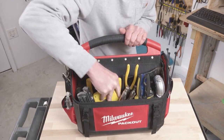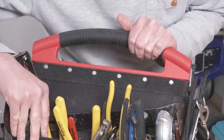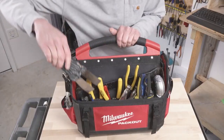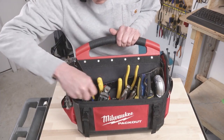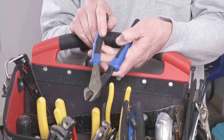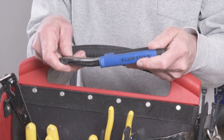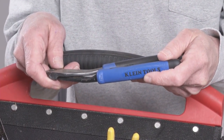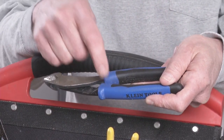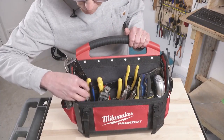I have a hundred-foot tape measure in here. I don't use it very often, but when you need it, it's the only thing that works. A couple of putty knives — one that's a real beater and one that's in a little better shape. These are the best diagonal cutting pliers to buy — these are Klein's. They're angled and allow you to pry and cut nails, pull out electrical cable staples, and cut off screws. They are supremely useful, and the ones with the blue handles stay way sharper than the ones with the red handles and last much longer.